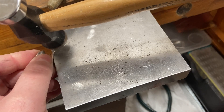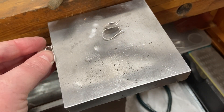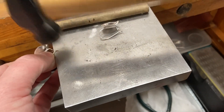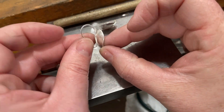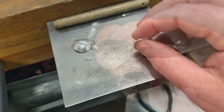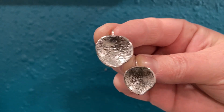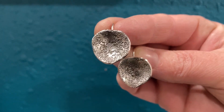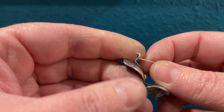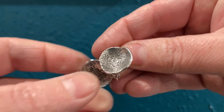This is not a necessary step — it's just how I like to form my ear wires. Then you're going to sand and polish the ends of those ear wires to make everything really smooth. You can put a patina on the fairy dust pieces — it looks really beautiful when there's some contrast between the high and low spots. These look pretty good; the catch functions. This is after a patina and polish — you can see the fairy dust texture really pops when you put a patina on it. I just threw them in my magnetic pin finisher for a few minutes. You could put them in a rotary tumbler or polish by hand. That's how to make your own fairy dust earrings with a catch.